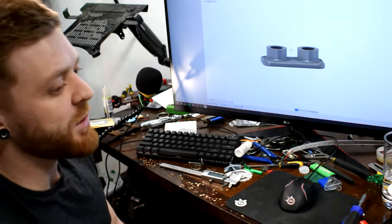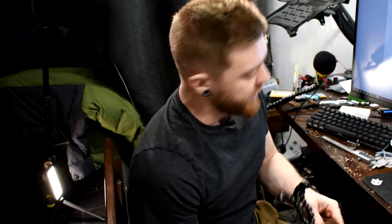Because of that, you don't have any pickups or put-downs of the nozzle head, so there's very little cleaning up depending on what it is. You can also do really intricate supports. You do still need supports — if you think about it, if you were printing me upside down and my arm was down here, this would be floating in space, so you'd need a support coming down to hold it.